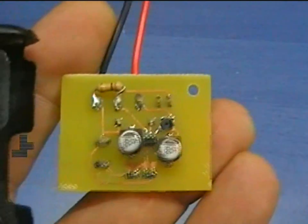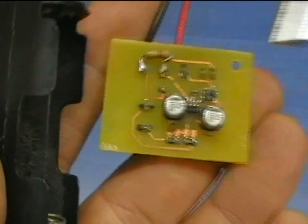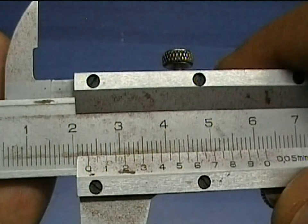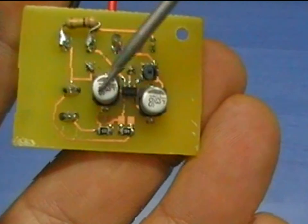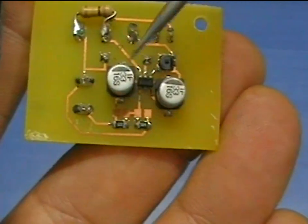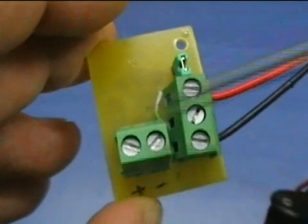Here is the prototype that I made. This PCB can be trimmed down to 23x23mm. I used SMD electrolytic capacitors, but Microchip suggests ceramic capacitors, which are even smaller. And if you also remove the gigantic terminal that I used, the PCB can become less than 10x10mm.